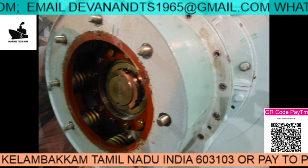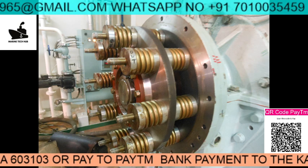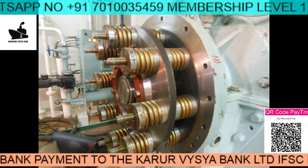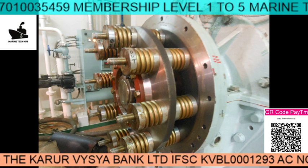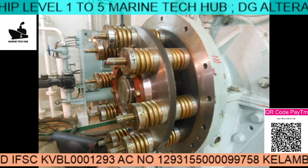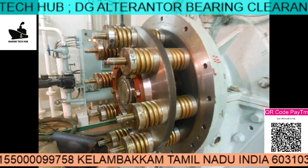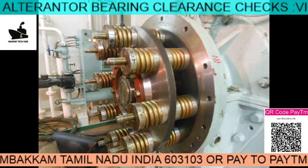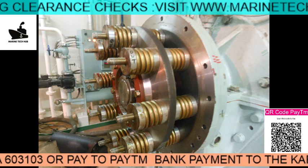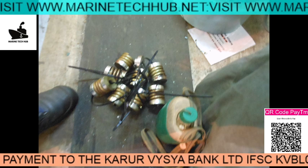Keep all the items together. Once you open the cover you can see the springs — these are used for damping effect. Remove all the springs. Engineers who have sailed on ships will not often get an opportunity to open this because the experience is required. In the dry dock they sometimes open this, so remove all the springs and keep them in one place, otherwise you may miss them.